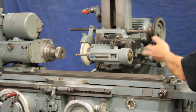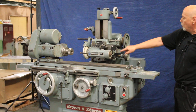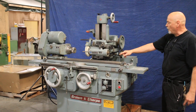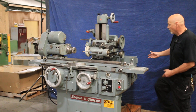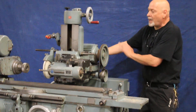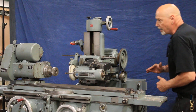For the video I've taken the guards off so you can see. Now we've taken the one belt that used to go over here and have another belt now that goes down here, and this belt goes here. The motor actually gets loosened up from the bottom and there's some scribe lines in the back, and the motor's actually been shifted over to this direction in order for all this stuff to line up.